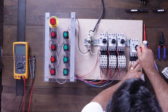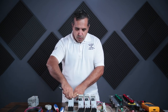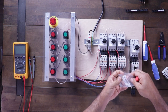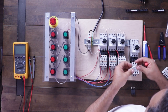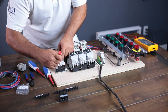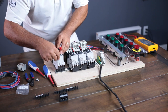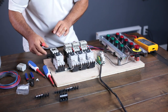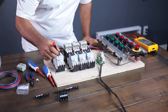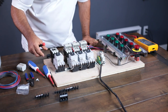So let's manually trip it — in the trip condition, this contact would open. If the overload pulls too many amps and trips, this alarm contact will also trip and cut the neutral to the coil, which will keep our motor from burning up. To install it, we pop off the cover, flip this over, and snap it in. On this particular starter, the normally closed has to go in the right-hand slot, not the left slot. We pop it in and we're done.